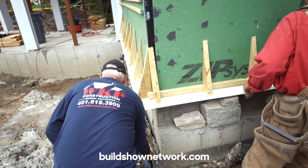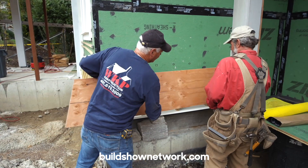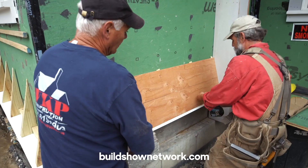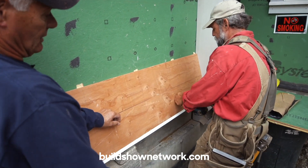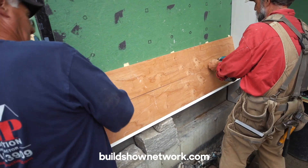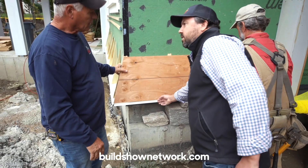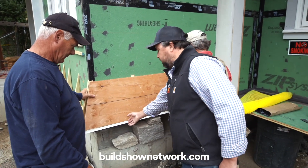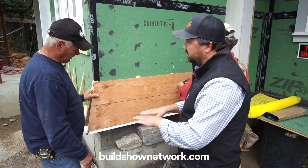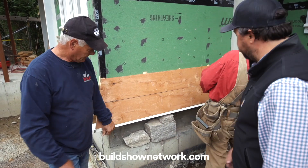The next step — I've got the sheet already pre-cut here. We throw half-inch plywood which has got a little flex to it; we can push it in to shape. We use exterior screws just so it can grab the plywood and bring it into the shape of the block. I've noticed too, Fred, that you've got the plywood flush with your cut on the trim so the shingles can come right over the edge of that PVC soffit material for a nice overhang. That is correct.